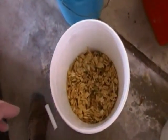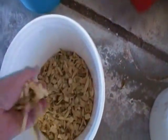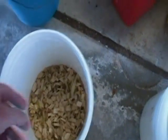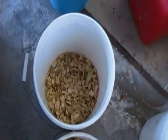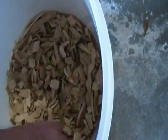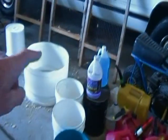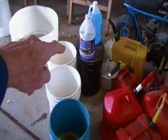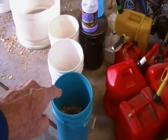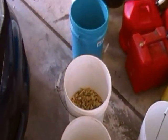Next, this is the stuff that would fall through the half-by-one sieve, and it has a definitely lighter feel to it — that looks like usable stuff to me. And then this final category is the stuff that wouldn't fall through the half-by-one sieve, probably two inches deep. The half-by-one material is probably three and a half inches deep. So there's the whole deal: first the longs, then the near-dust, then what falls through the half-by-half, what falls through the half-by-one, and what wouldn't fall through the half-by-one — all out of one pail.